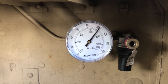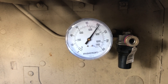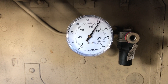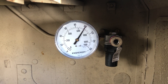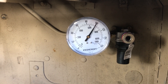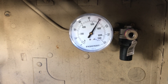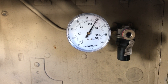There it is — the governor clicked. Now it'll run back down slowly. I have a known leak right here — it's a very, very slow leak. But basically that's it — it's all about the air governor. The tech manual says 100 to 105 psi, so set it there as a good starting point. Good luck.